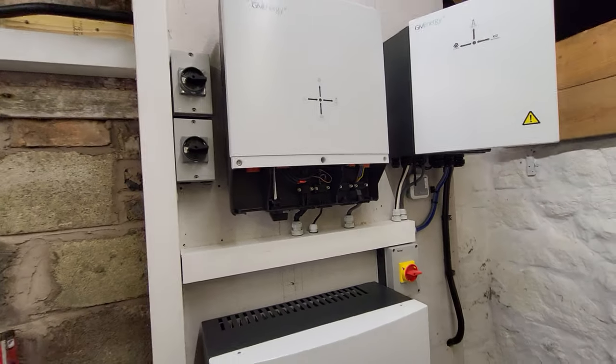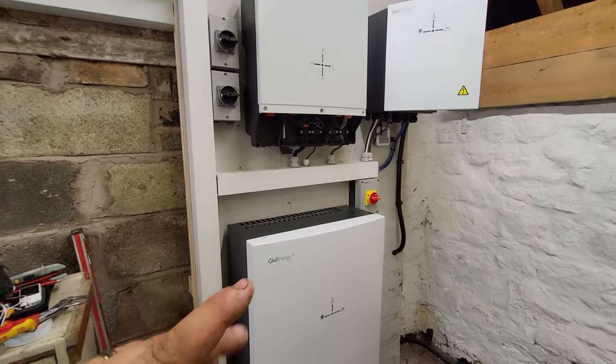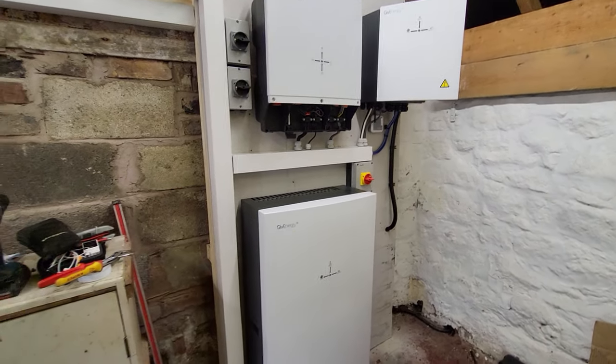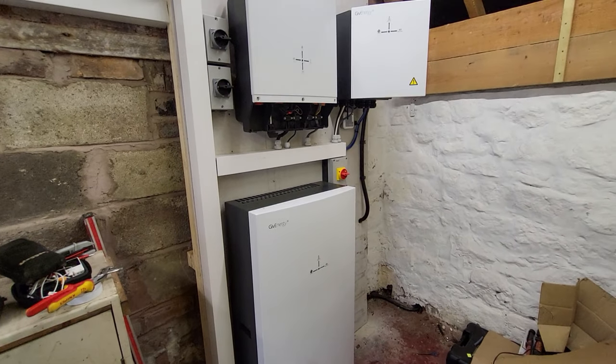And it's brilliant when you use electrical OM because it does it all for you in the software, and you know what kind of headroom you've got on your sub mains and on your final circuits as the install builds. Because when you are doing volt drop, it's not a case of running a cable a length of distance and then going to measure the volts on the end of it. It varies based on the load that you're using on the circuit as well.